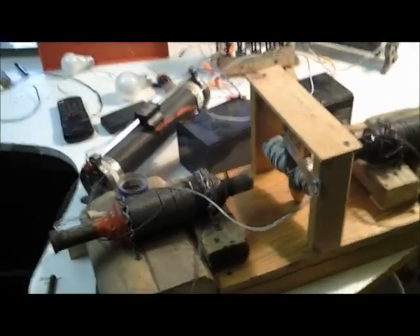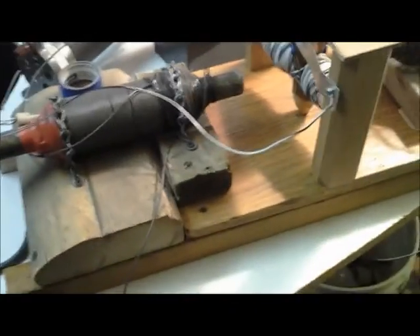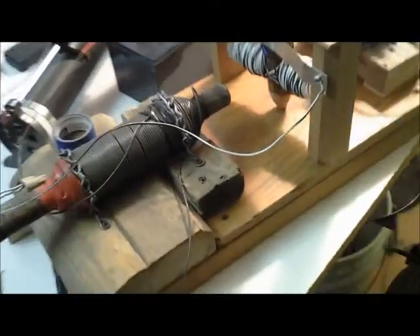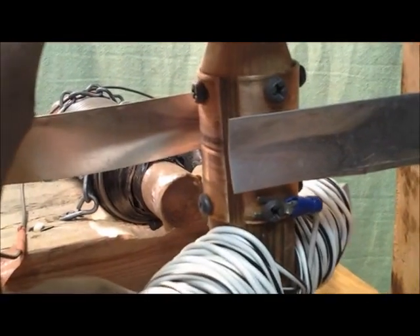Hi, Scott here. I'm in my studio and I have fabricated something using old parts from some of the other projects. These two coils you may recognize - I didn't feel like unwinding them. This is a simple DC motor with a rotor made out of wood so I could fabricate some bearings and get a commutator big enough without a bunch of fancy chemicals.